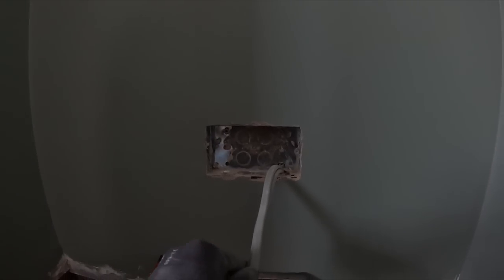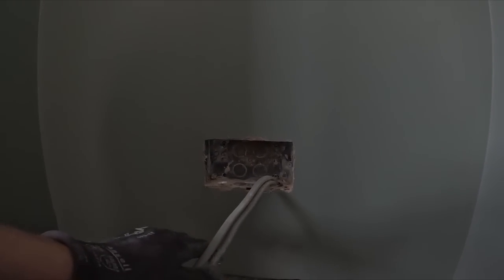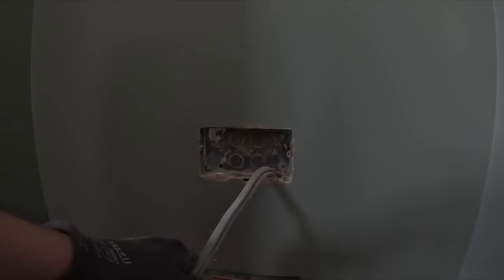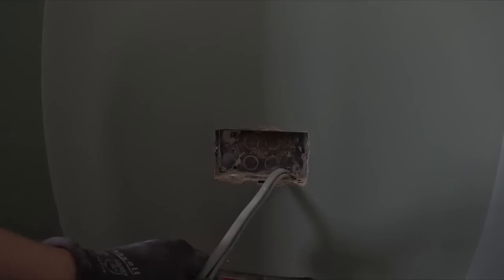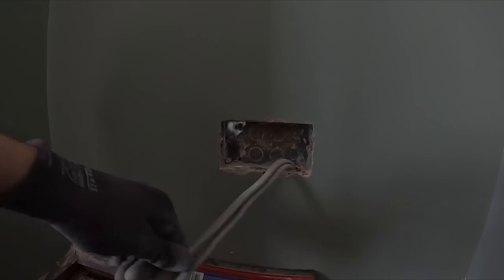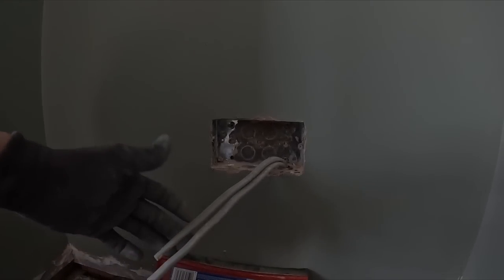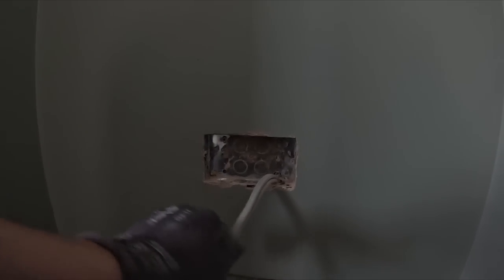Here's the Unilight knife — I'll literally just clean up the edges. And that's it done, minimal damage. That's ready to be second-fixed now. Obviously you can see that took me about five minutes tapping all that out, but in a room with five or six sockets that time adds up — which is not really added onto the job, it's not expected. Plasterers — we don't really like them for that fact, but hey ho.